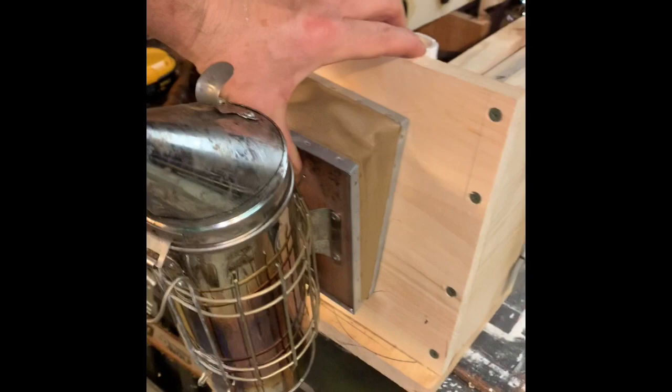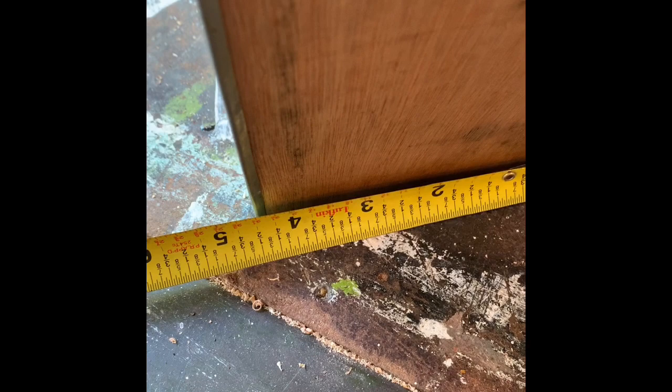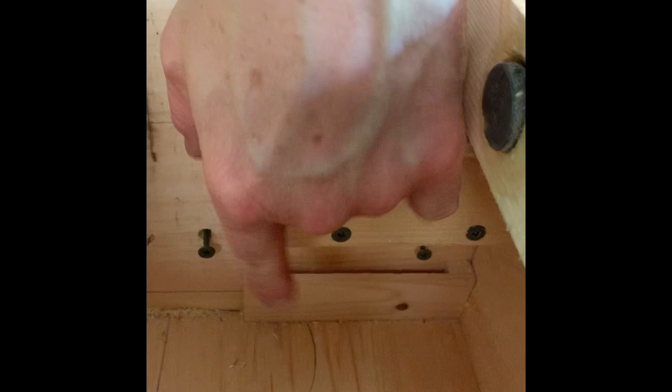We will probably put a strap around the smoker. Now I need to make a base for the smoker, so we'll cut some pieces of scrap wood about four and three-quarter inches wide for the base. Now that we have this assembled, we will fasten it to the front of the toolbox as the base for the smoker. With this in place and secured from the bottom, we'll go ahead and insert a couple of screws on the inside so that it will stay in place.